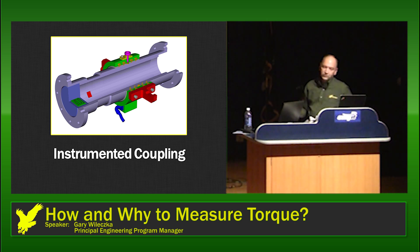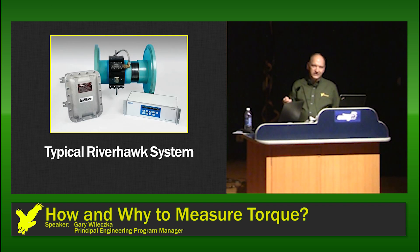In our example, we're talking about a resistance change of only a tenth of a percent for 500 micro-strain applied torque, generating 10 millivolts output. The 500 micro-strain, which is typical for a torque meter, represents a change in length of that one-inch strain gauge of only 0.0005 inches — very small. That's a 0.05 percent change in length, generating a 0.1 percent change in resistance values, and 0.1 percent output voltage. But we amplify that and get a usable signal.